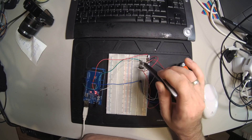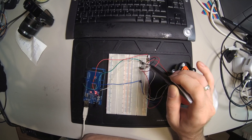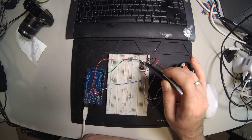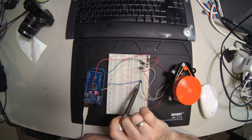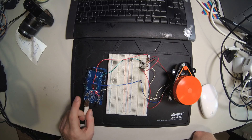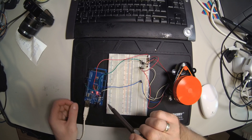The control of the negative is over this MOSFET, connected with the drain. The source connects to ground, and the gate is connected over a 10 kilohm resistor to PWM4. There is also a second 10 kilohm resistor going to pin 8 of the LDS sensor. This completes the wiring and connection of the sensor, and reading it out with an Arduino Mega — even the Chinese version of the Mega is enough to get it running.